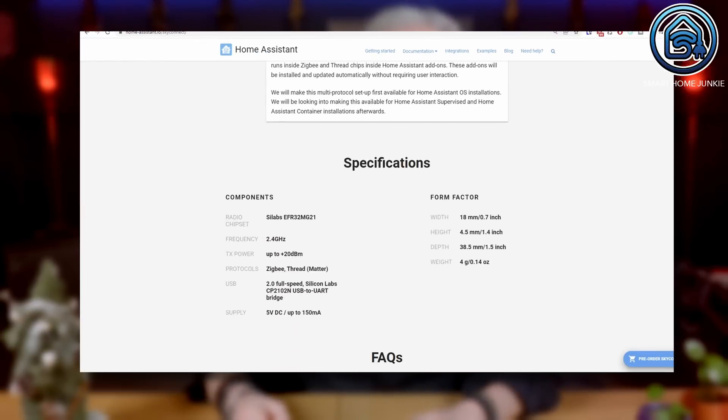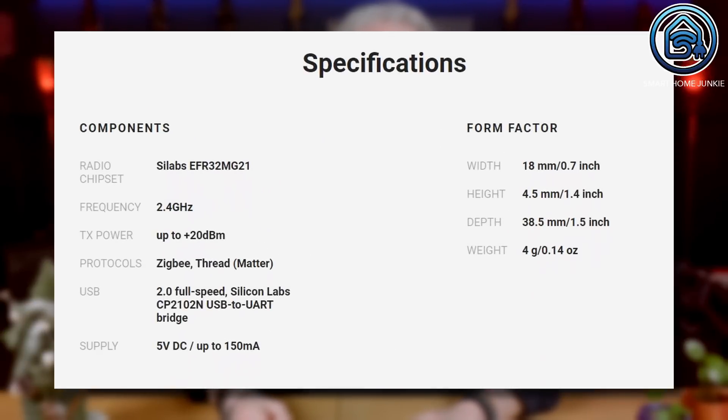Results may vary at the moment. I tried to install it using Zigbee2MQTT but I couldn't pair a test IKEA light bulb yet, so I think it's too early to say that it works well with Zigbee2MQTT. It runs on a frequency of 2.4 GHz and has a reliable range of up to 20 dBm. At the time of this video, it supports 64 devices to connect directly to the dongle, but because you build a mesh network, it can support far more than this number of devices simultaneously.